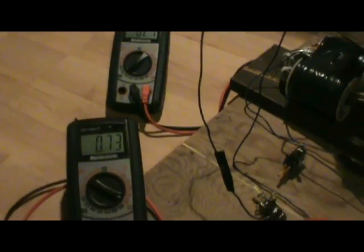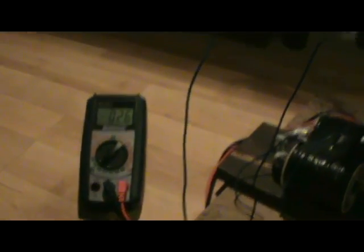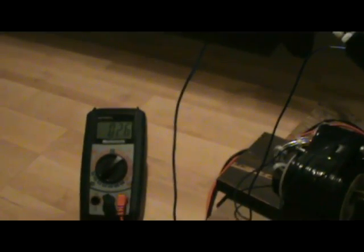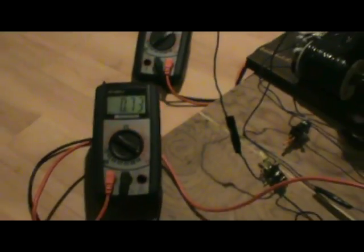Still climbing, maybe. I hear it. So I've closed that circuit. It's gone through the full wave rectifier and through that light bulb. And the wheel sped up. We're at 2.3, 2.4, now we're up to 2.7. The input amps dropped. Now I'm going to engage this coil, and this leads up to this upper one, right?